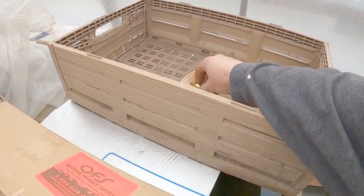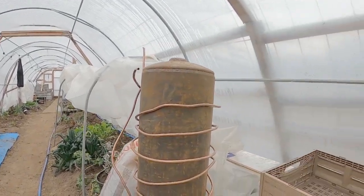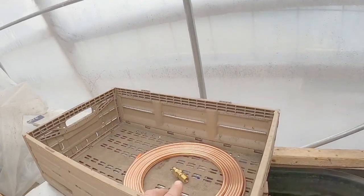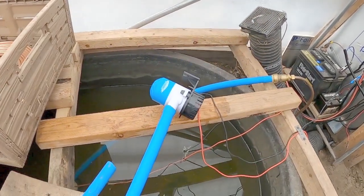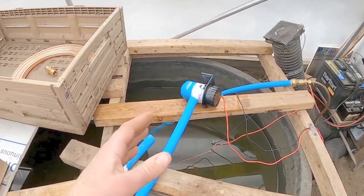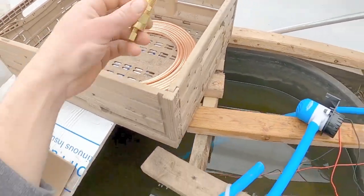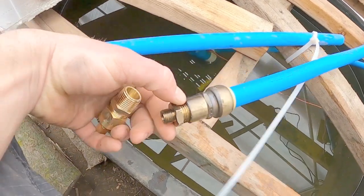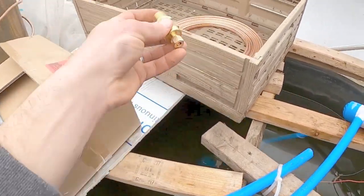I got another fitting to connect this copper. You can hear that wind and rain and snow hitting the greenhouse — it's so loud, like waves and sheets. So I got this quarter-inch copper tubing, picked that up to use as a water pump system and basically a water heater. I'm going to be taking this 600 gallon per hour pump off of this system and using a 300 gallon per hour pump — downsizing quite a bit. That is going to screw right into my PEX where this fitting did. This is the new compression fitting for our quarter-inch copper.